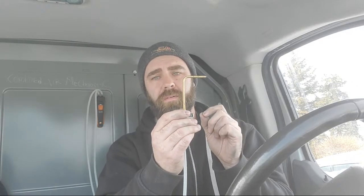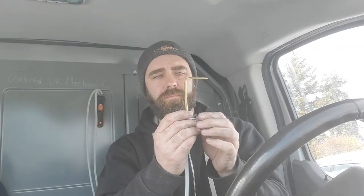The argument is: which way do you put it in — facing toward or away from airflow? From what I've read, including from the manufacturer, the tip breaks up the velocity so it doesn't affect the pressure being exerted on the side holes. So the way I put it in is toward airflow — some people say it doesn't matter, but that's my reasoning. When we have pressure in a duct, that duct is basically ballooning outward. You want the holes to be perpendicular to the flow so the pressure builds and you can measure static pressure.